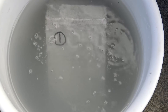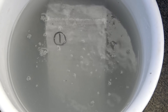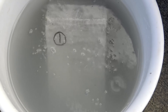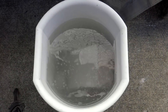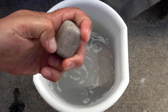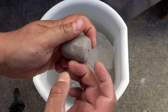Now this material is weather-resistant, but not waterproof. If you notice, you can see how porous it actually is — all those bubbles were water rushing inside the concrete. What they found recently is that Roman concrete was just like this, with the exception that they used seawater. The ocean water would soak into these structures, bond with the minerals, and create new minerals. It would replace those holes, solidifying it and making it a gigantic rock. These two samples have set for 24 hours, and as you can see there's still no damage to them.